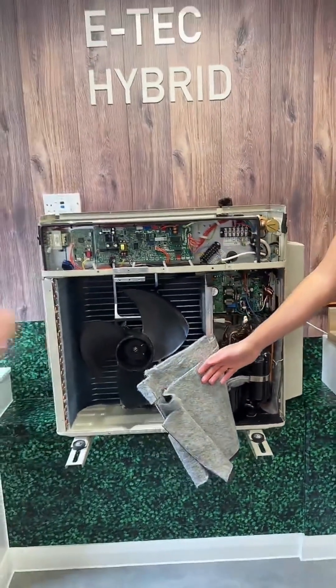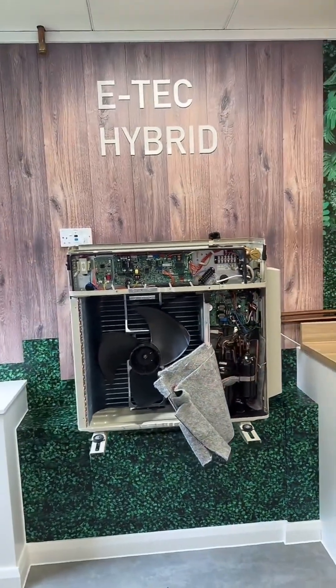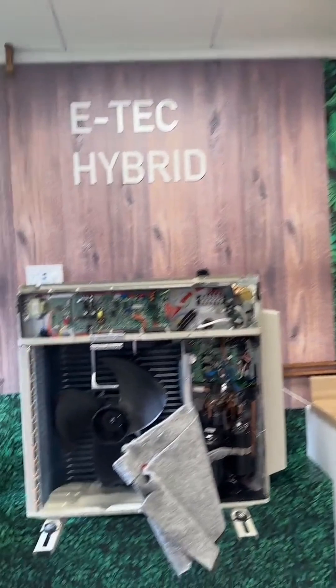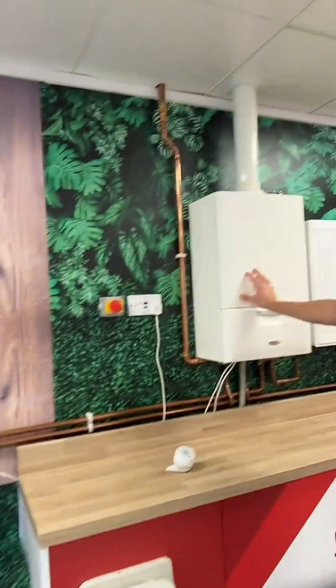So this is just a standard style heat pump? Yeah, it's a heat pump minus a pump — it doesn't actually have a pump in it. A monoblock that I'd have a pump inside — so a usual monoblock heat pump would tend to have a pump inside the heat pump itself. We're using the modulating pump in our gas boiler.